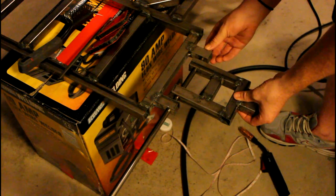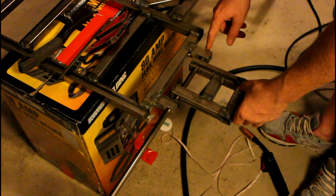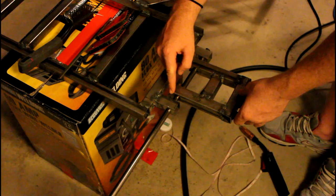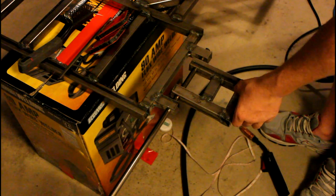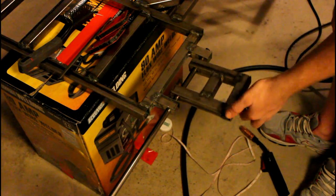And so what we're going to be doing is we're going to measure this up to this side. So we have a quarter inch of tube sticking out on this side. We're going to weld it, measure a quarter inch over here, weld it, and then weld the inside as well, and then just cut it. So it's all lined up before we even cut it, so we don't have to worry about parts misaligning or things like that. So this is really cool seeing this, because it's just a big step on things coming together for the go-kart.